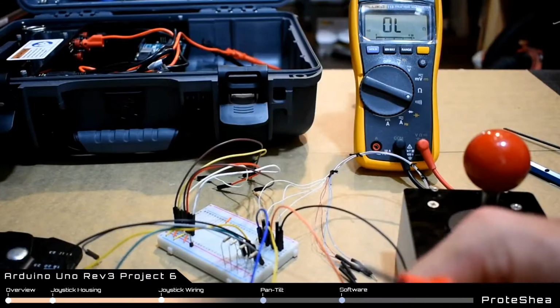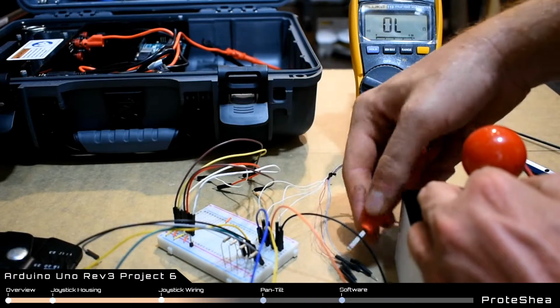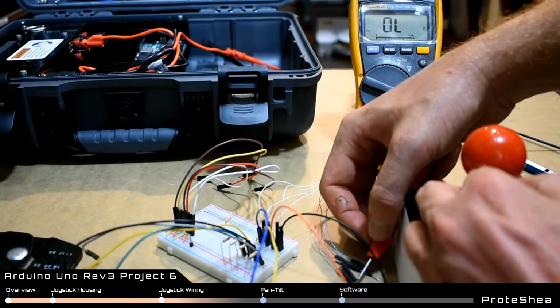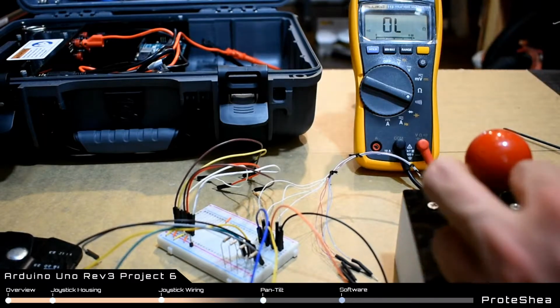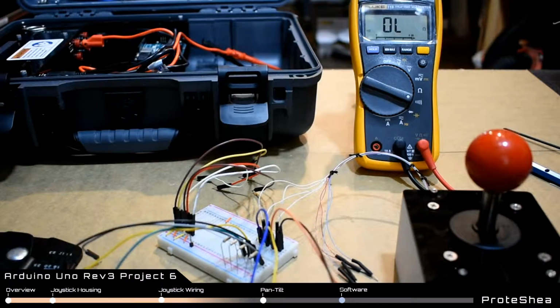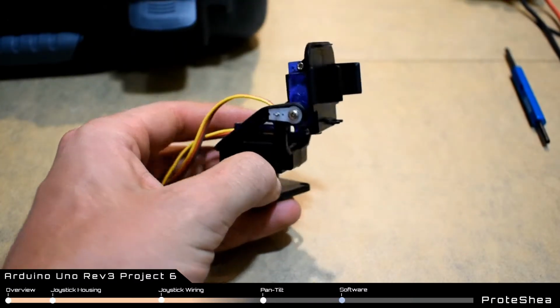This next part can be a little tricky, which consists of identifying which wire is connected to each limit switch. So we used a voltmeter to determine each wire. Once you have identified each one, you can insert each wire into the node that a 10 kilo ohm resistor is connected to.